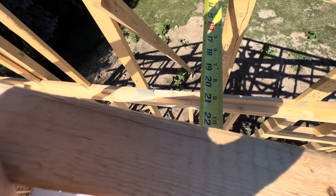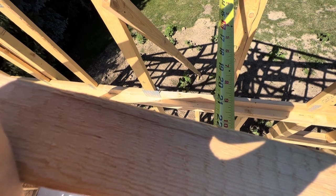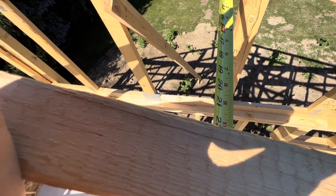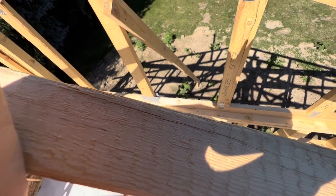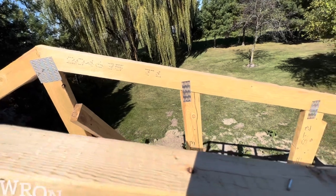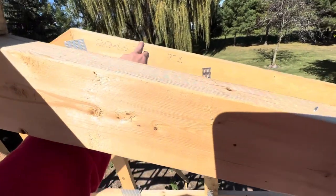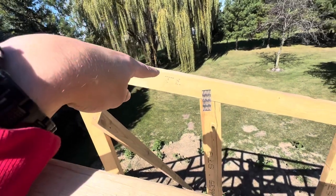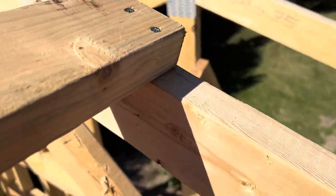That board will be 24 plus 12, so that'll give us 36 inches, or three feet. We'll go and cut three-foot sections and nail from outside here, toenail onto this top plate. Then we'll put blocking in between — the measurement is not exactly 24.